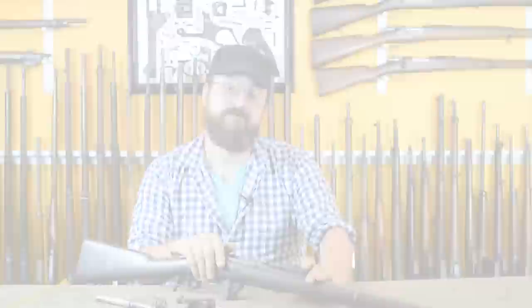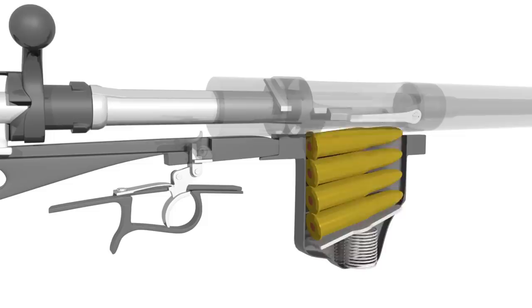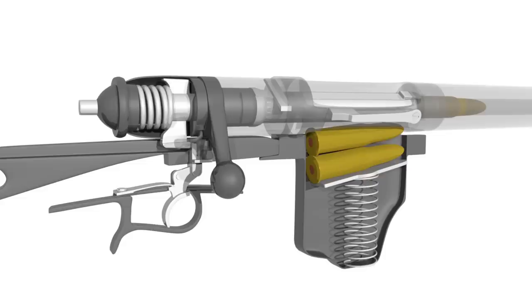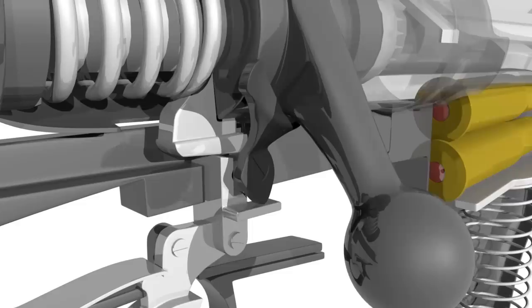First, we'll load this gun up from a four-round charger. Here is the magazine cutoff, set in place of the old dust cover. With it on, we have a single-shot rifle. Flip it over and we feed from the magazine. Note the locking collar, which is actually one piece with the bolt handle and locking lugs wrapped around the bolt body — a separate component. The striker is reset rearward when we open the bolt, cammed back by the diagonal surfaces at the rear of the locking collar. Here we have the safety, which disengages the sear and essentially allows the gun to decock — although unlike the earlier Claverino, this one blocks the bolt handle so it can't quite go into battery, keeping the firing pin off a potentially live primer.